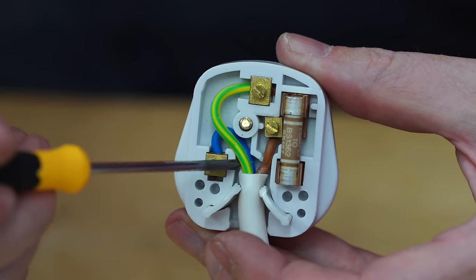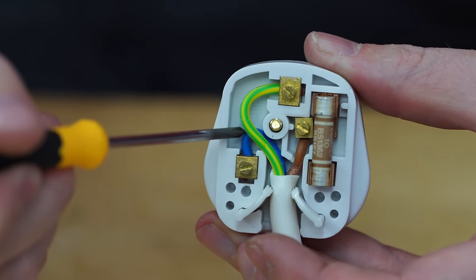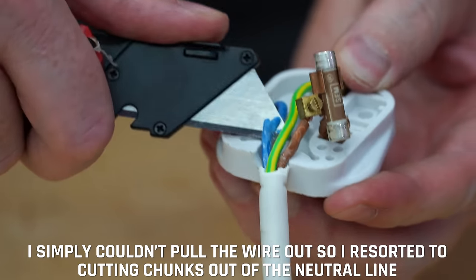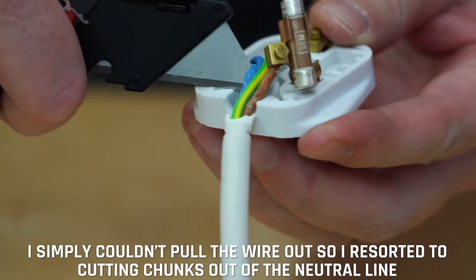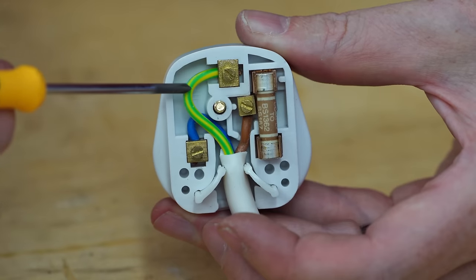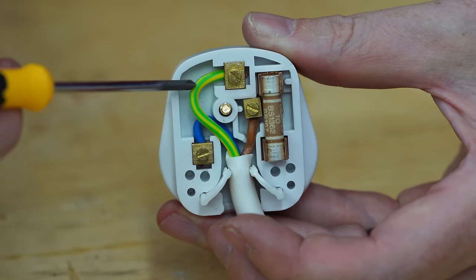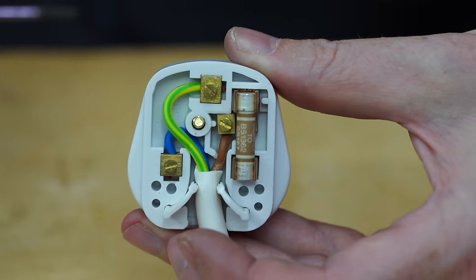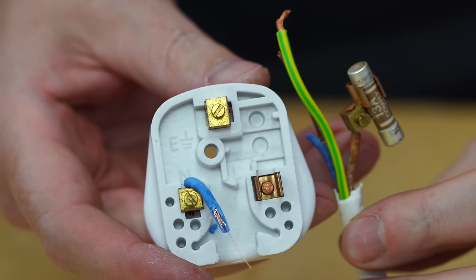The second one is this blue or the neutral one here that's underneath, and that will get pulled out next, and at that point you have no electricity connected, just your ground. I think it's pretty brilliant that there's extra slack built into the ground. There's very little but a little bit of slack built into the neutral and no slack built into the live, so that if this gets ripped out, it pulls the electricity first, again, keeping the user safe.